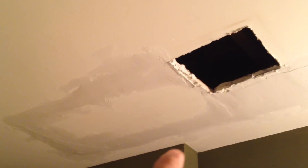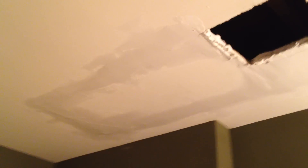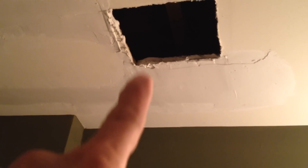Simple job. Now I'm going to show you a trick. I told the homeowner I'm going to do this too, because he wanted to save some money — I said okay, I'll save you some money, I'll show you how to do it. Instead of going through a whole big cut-in, the only stud is literally right there on that edge, which would create a major problem. So what I did was I surgically removed that piece, saved it, and also saved this piece here, because I cut two sections out — first this little section, then when I knew where I needed to cut, I cut that section out. I saved both pieces.